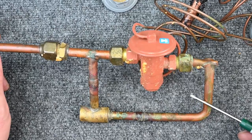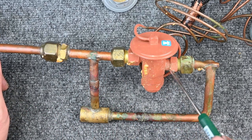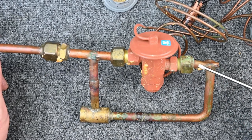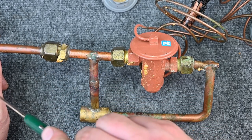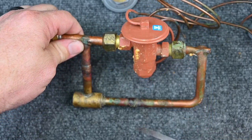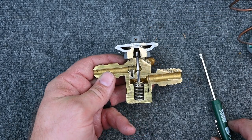Here's a model with an external check valve. When refrigerant flows one direction, the check valve is closed and refrigerant must be metered through the TXV to the evaporator coil. When refrigerant flows the other direction, it pushes the check valve open and bypasses the TXV altogether. So internal and external check valves serve the same purpose — allowing heat pump reversibility — just mounted differently.